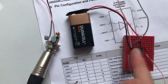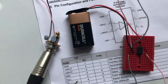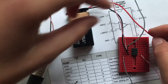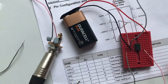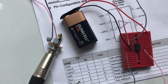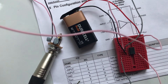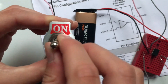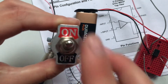I didn't really want to keep unplugging and plugging back in the battery, so I'm going to quickly introduce a switch to the circuit. I'll disconnect by unplugging the positive side of the battery. I'm now going to connect up the break in the circuit by implementing a switch, which is connected to two wires. I'll connect one side of the switch here and then the other side to where the red battery wire was. Currently the switch is off — let's connect the circuit by turning it on. Hopefully you can hear the buzzing, which means the switch works.